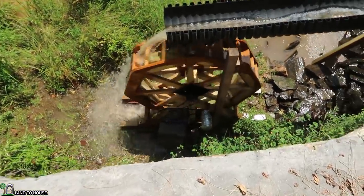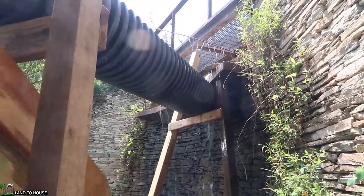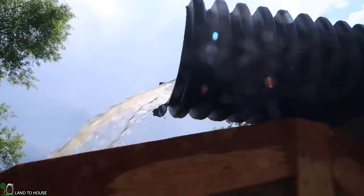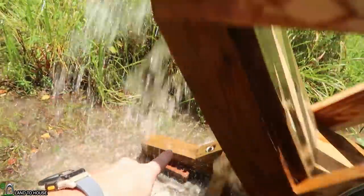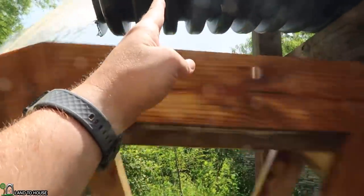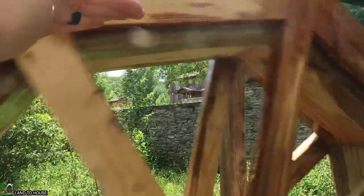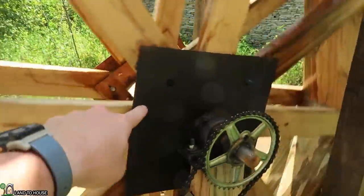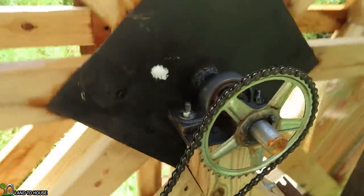Let's walk down and see if we can get an RPM reading on that motor down there. The total waterfall is somewhere around six and a half to seven feet from this point, and you can see it's hitting the wheel right about here and most of it's falling out about right here. I think if the water came in closer to the top, a couple of ribs in, it'd have more time to settle and pull the wheel down. He's got an inner board cut at a very specific angle, cross braces coming down to a metal plate, a block in there for the center shaft, and some bearings here that allow it to run quite smooth.